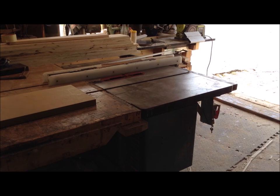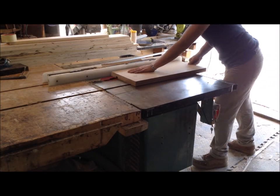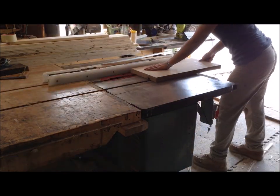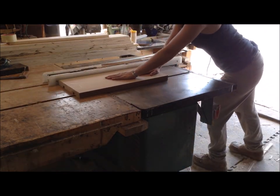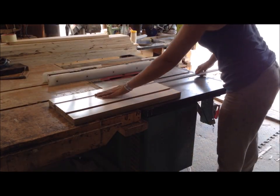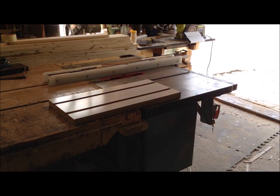Finishing up the end boring jig was easy. I made the two slots symmetrical, coming in about 2 inches from the bottom and 2 inches from the top to make two slots. This section uses the thicker track because I ran out of the mini track, so these dados are half inch, not 3/8 of an inch.